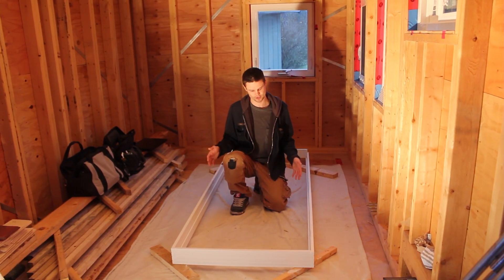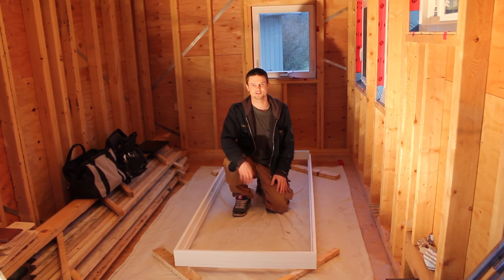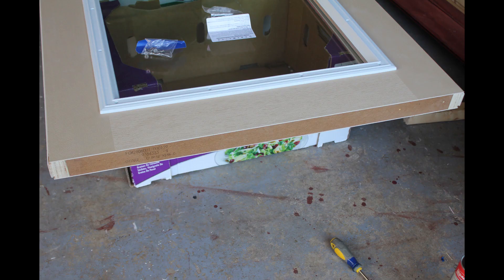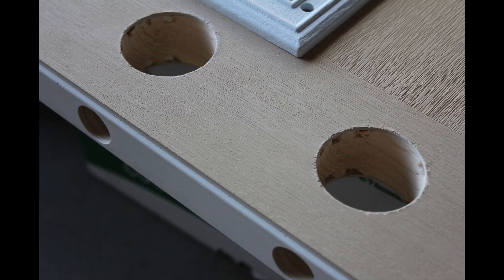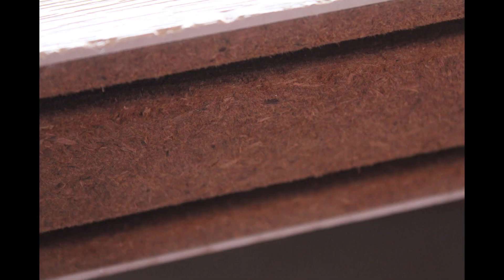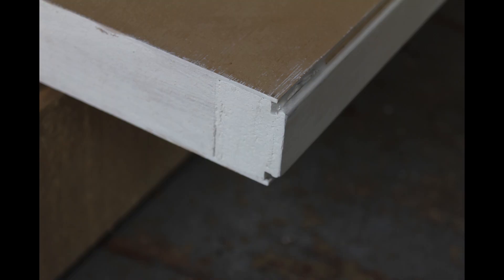Now that we've got the replacement, the first thing we did was separate the door from the jamb by completely removing the hinges from both sides. We then examined the door closely and identified all the vulnerable spots — there was exposed particle board along the top, wood exposed from chiseling behind the hinges, exposed wood where the hardware goes, and along the bottom a very fibrous particle board with a couple grooves cut into it. We sanded down all of the exposed wood we found, then applied an oil-based primer sealer to get the first layer of protection down.